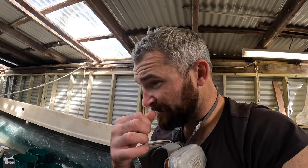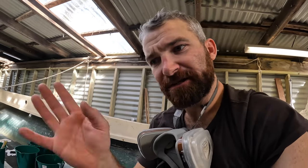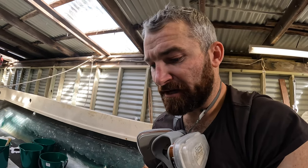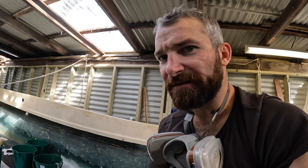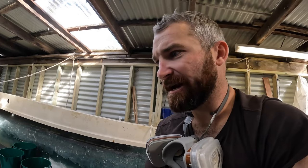throw some wax into that, and wax in styrene, and I'm gonna coat this surface, only the surface, not up the sides, because we're just gonna leave that as laminating resin for the time being. But what I want to do is cure the floor off completely tonight so I can actually walk on this side, but also it's going to make it easier to sand those air bubbles out, patch those spots.